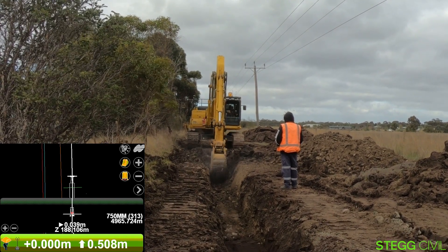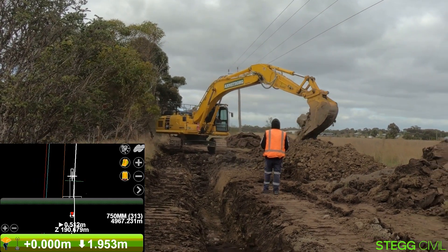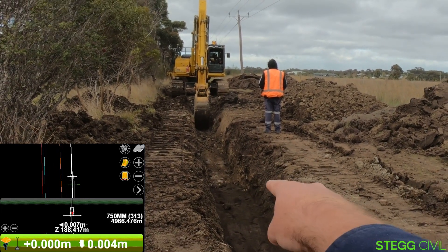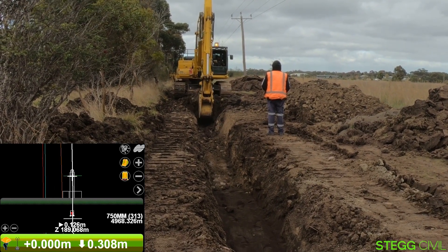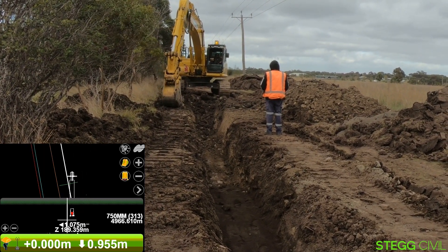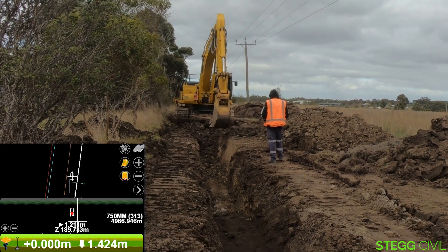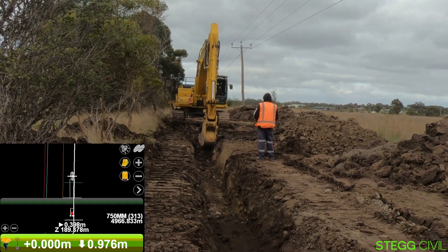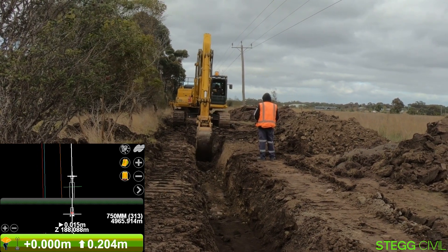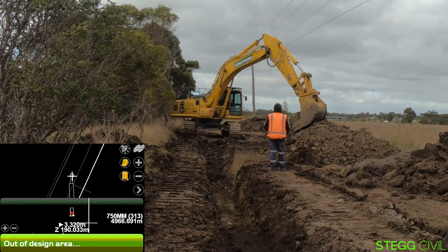There's a nice big rock he's just pulling out now — it's a 36-tonne Komatsu just breezing through this ground, but there are a few big chunks of rock that are a bit of a pain. He's dug about 100mm, maybe 150mm underneath the bedding height — he'll be digging a certain amount underneath the invert. Now he's just tidying up the trench, cleaning up the top, and then he'll heel the bottom so it's nice and solid.